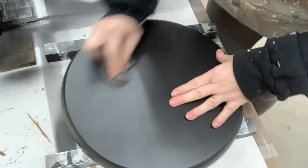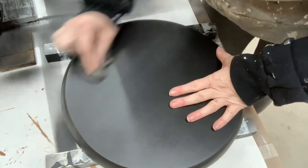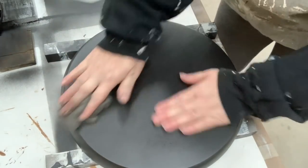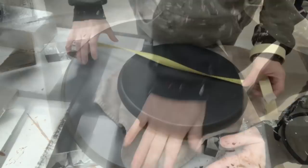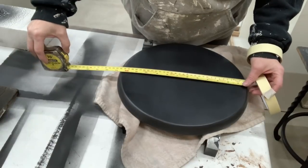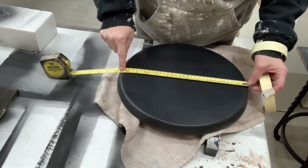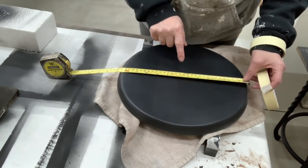After the polycrylic dries I'm not really going to distress this piece, but I'm going to take some steel wool — the fine 4-0 steel wool — just to take down any bumpiness that the spray might have left behind so I have a nice smooth finish. I wasn't going to distress this piece because, if you're new to my channel, I love grain sack stripes. My regular viewers know that. This is just something that sells really well for me so I take the time to do grain sack stripes.